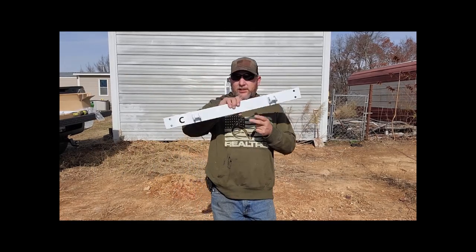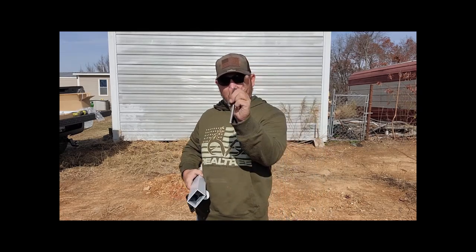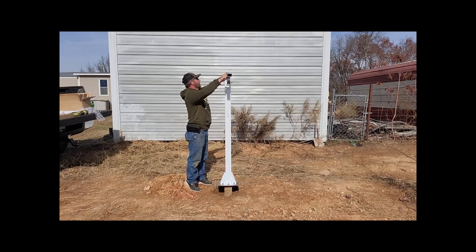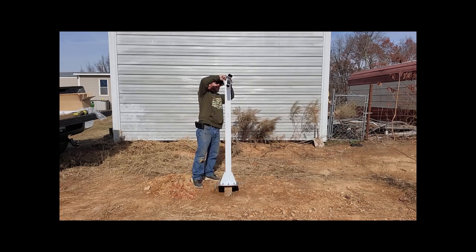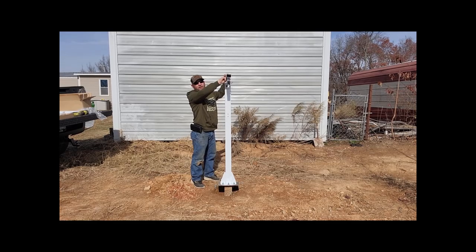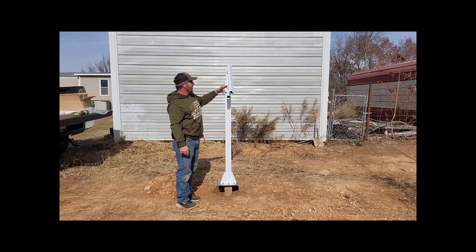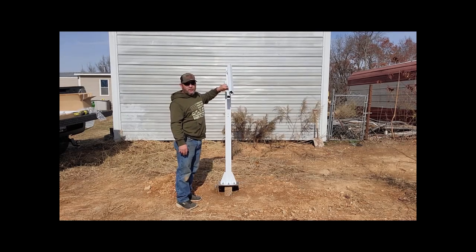The next part is part C, and it doesn't matter which end goes where. It goes upside down like that with these two little pins and cotter keys that go through them. A good little hint that I got from Tony over at Southern Solar Academy is to put the pins in with the heads facing north, because your solar array is going to be tilted to the south most of the time, and that will keep the pressure off your cotter keys.